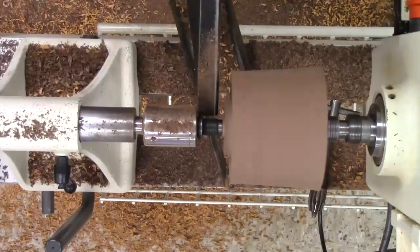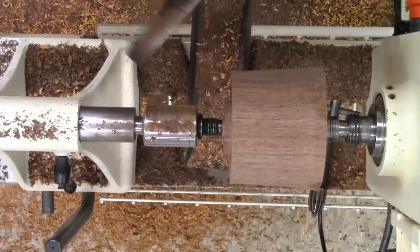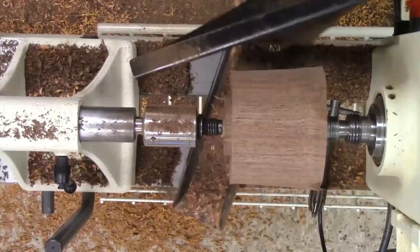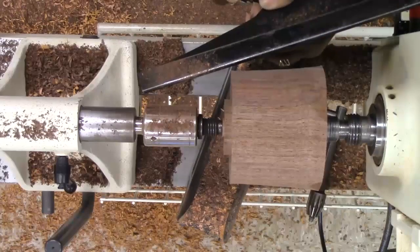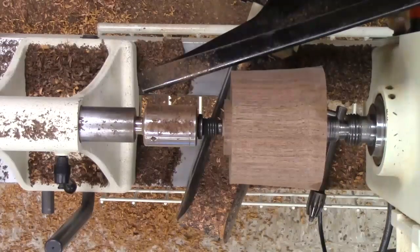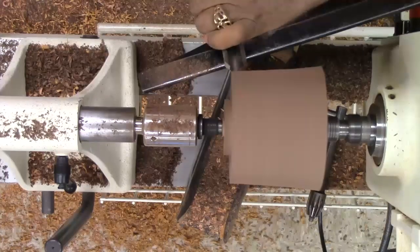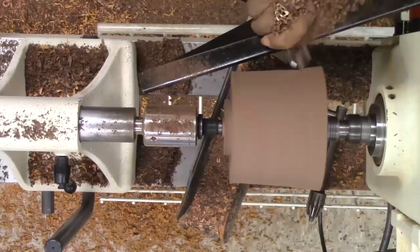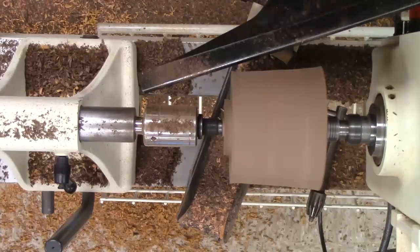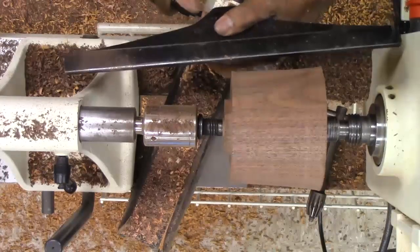Now, the side grain that you're talking about, if you do, this is end grain, it's not going to move as much. If you do use side grain, I would suggest you rough the thing out, the top and the bottom, put them in a place, and give them time to be rid of all the little stresses that you took out of it.